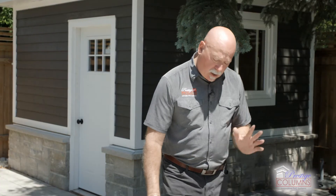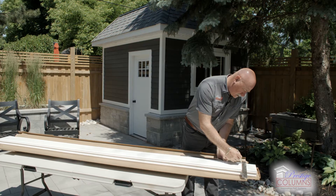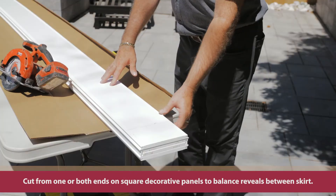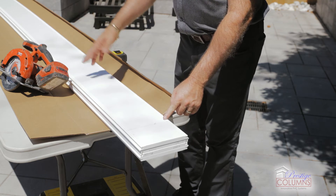If you don't have a miter saw, go ahead and use a framing square to put a square line across through that mark. I'm gonna cut all four at once because I have good confidence cutting four at a time. If you prefer to cut them individually, please do it from the back side so that you don't scar the finished surface of the column.